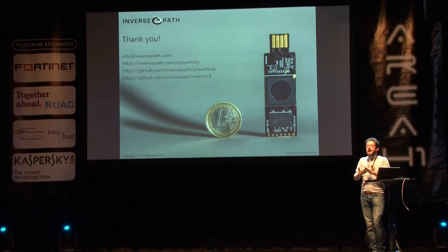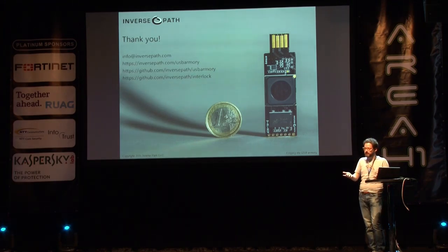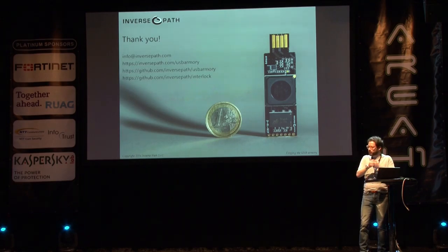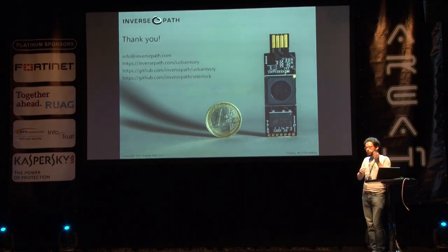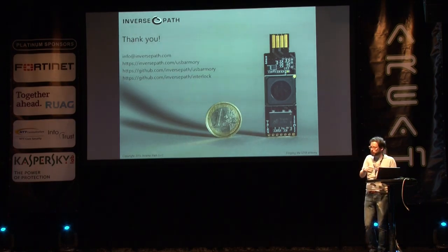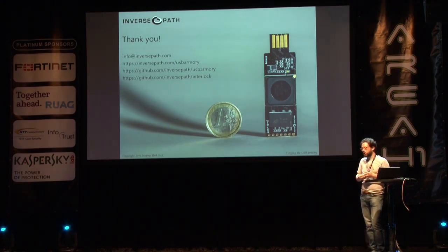If you want this to be unattended, let's say you have an IoT device, and you want to have the firmware encrypted, and you don't want local attacks to be able to extract that firmware, then you need to do secure boot, and then you need to read the symmetric key from the SOC itself, so not from an external memory, where the bus can be intercepted on the PCB.